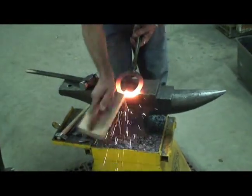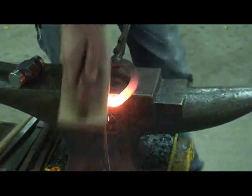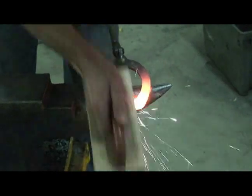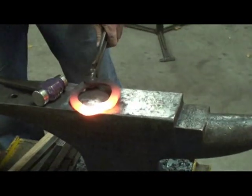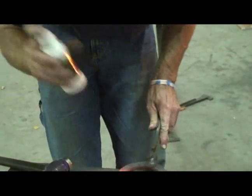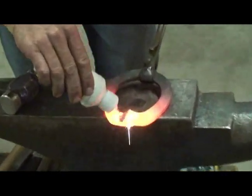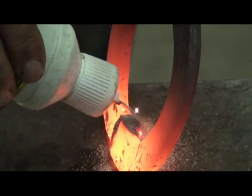We're going to take an overall heat — all I'm going to do is clean it all up and get the oxidation off of it. I've got my Iron Mountain Flux. With Iron Mountain, you shake it up real good before you use it because sometimes if it travels it separates. Just cover your seams with the Iron Mountain — get all four sides: front, back, top to bottom.